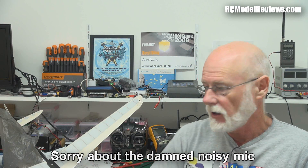Fortunately I have the fail safe set, so it didn't fly away or crash. It just did some really tight turns — a very tight, slowly descending spiral — which gave me plenty of time to have a look and see what was going on. I looked down at the transmitter, the LCD was blank, so I turned it off, turned it on, and it went again. Once the transmitter started working I just brought the plane back in and caught it — that was the end of the problem. But why did the transmitter stop?